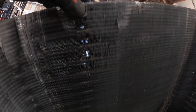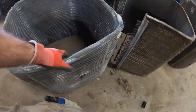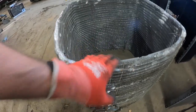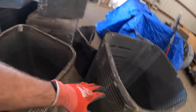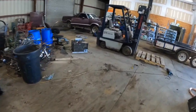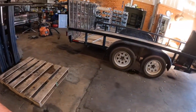These are aluminum fins on copper tubing, where this coil is 100% aluminum. They'll take and join the aluminum to the copper here, so we don't have to do anything with these — I'll have to cut this bit of copper off of each one of these and these just get loaded on the trailer. We've got quite a few of those. Anyway, that's a breakdown of the coils and we're going to finish getting these ready to take to the recycling shop.